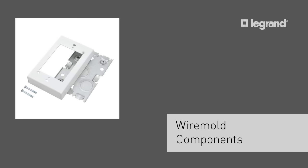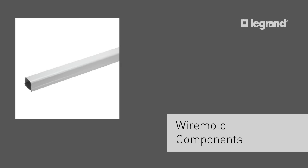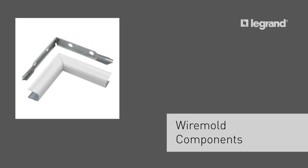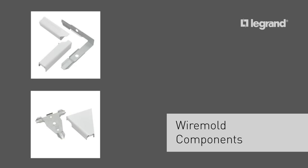The wire mold parts we are going to use for the project are: a starter box for adapting an existing outlet as a starting point for the wiring source; an extra deep outlet box for housing larger device controls such as fan speed control and dimmer switches; wire mold metal raceway to carry wires downstream from the starter box; a flat elbow for a 90 degree turn up the wall; and an inside elbow for a 90 degree turn to transition from wall to ceiling. For our fan project we need a fan box — use wire mold V5738-AF for ivory and BW4F for white.